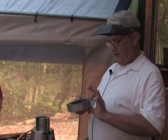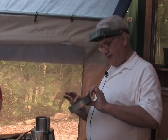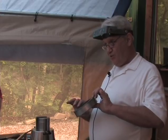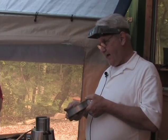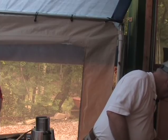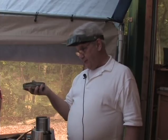So this is diamond, and you can sharpen carbide on this very easily. This is a coarse wheel, and this wheel is probably a 2000. So this is finer than most of the stuff that GRS has. And then he gave me a couple of these really fine ones. I have no idea what the grit would be, but I'm guessing they'd be about a 5000 or more.